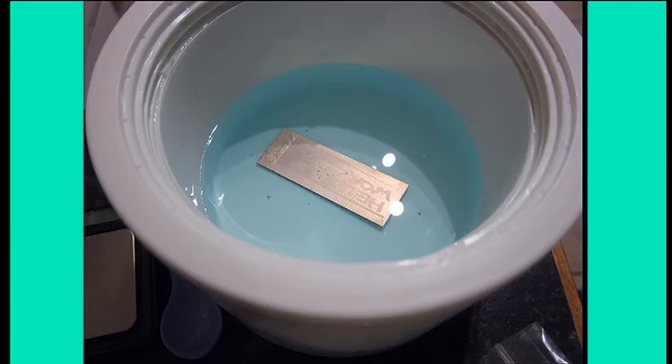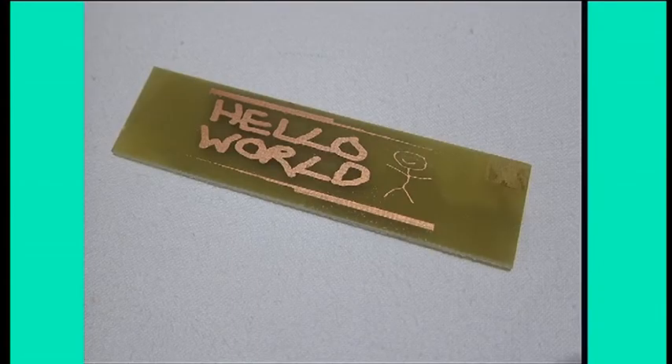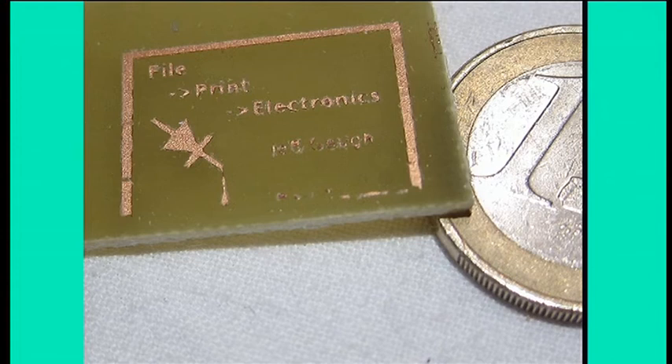Here's the finished raster image, etched in the bath, giving a patterned board. The first attempt had lots of pinhole defects — not very good as a circuit board — but I changed the settings and produced a thicker layer, and the second attempt is almost perfect with very few pinhole defects. I then started pushing the resolution to see what kind of features I can create, and they're getting pretty dense.